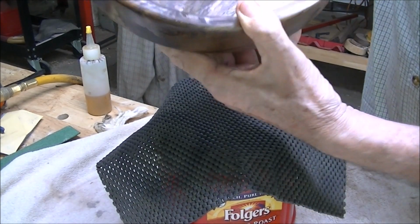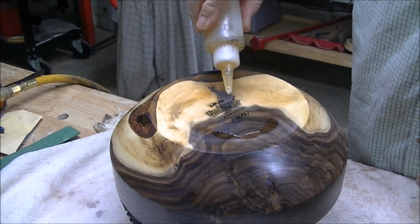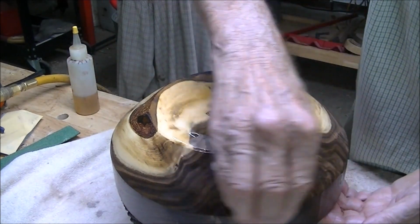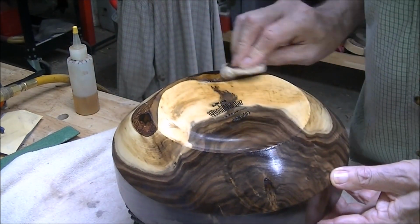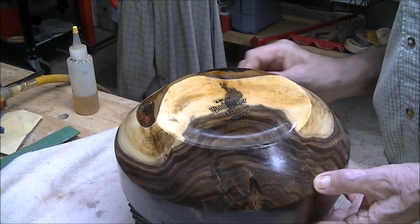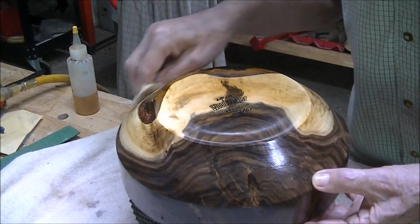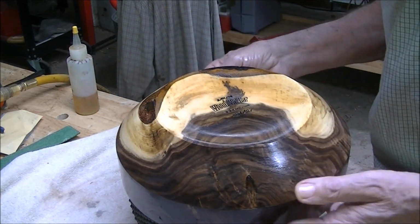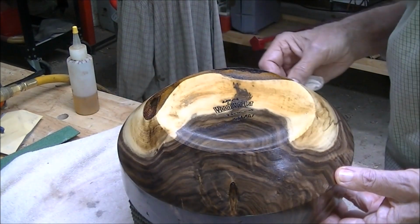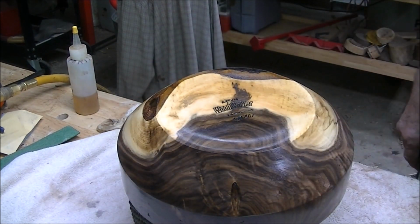I've still got to put more mineral oil on the inside. Right now I'm putting Danish oil out here, and after this dries I'll steel wool it just a little, just enough to knock any raised grain down, and that's about it. There you go, my friends. I get her done, I'll put it on the final clip and we'll go do something else next time. See you later.